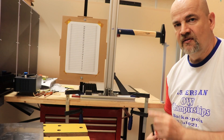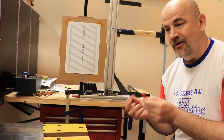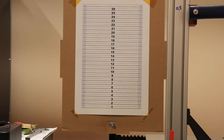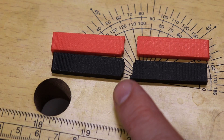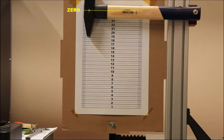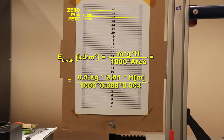With the Izod impact tester and this half-kilogram hammer, I can see which of these two materials is more brittle. In theory, PLA is more brittle compared to PETG, but let's measure it. PLA first, then PETG. For the first look they are very similar materials and both are very brittle. But checking the numbers — zero position of the hammer, after breaking PLA, after breaking PETG — yes, PLA is the more brittle material, but the difference is very minimal.